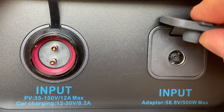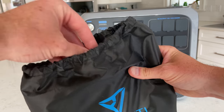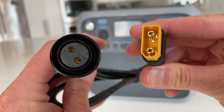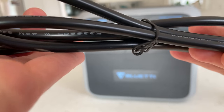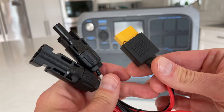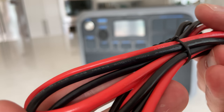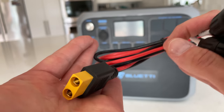On the right hand side is an 8mm input for the wall charger. So let's talk about accessories. It all comes in a nice bag to keep things organized. The first and most important cable is the Aviation to XT90 cable — that plugs in and the XT90 connects to other cables. There's an XT90 to MC4 for pretty much any solar panel, and an XT90 to 12 volt cigarette lighter. I'm pretty impressed by the quality of these adapters and that they're all included in the box.